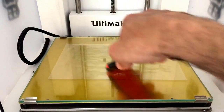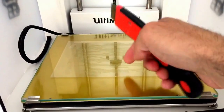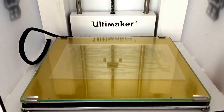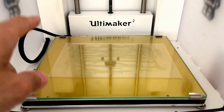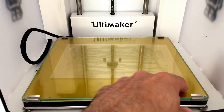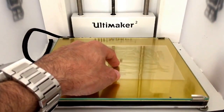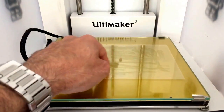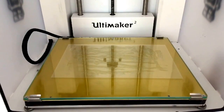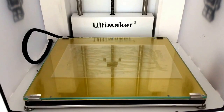So there it is. And what did I just do? I left a mark on the thing. I mean, this will be printed here. With Simplify3D, the nozzle will come down here, will eject some of the material, and then it will drive here and diagonally reach the position where it will start making a brim around my print, and then it will start extruding. I will shoot a piece of video to also show you how the Rigid Ink filament behaves, to show you what I mean when I say that it really expands when it's extruded.